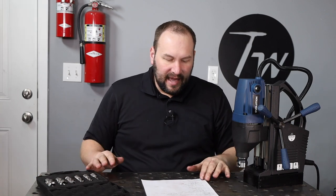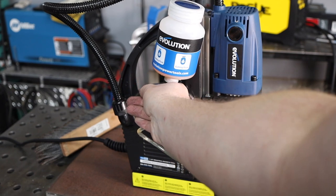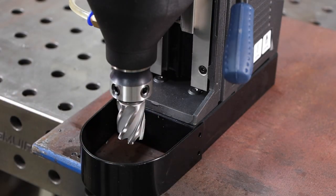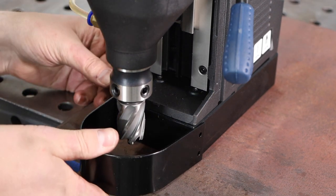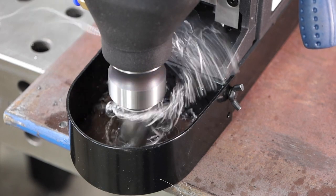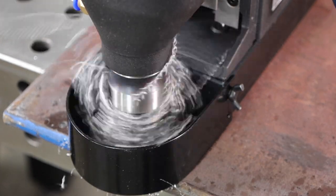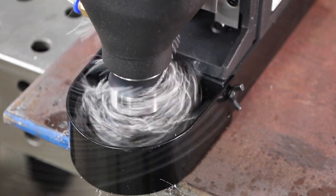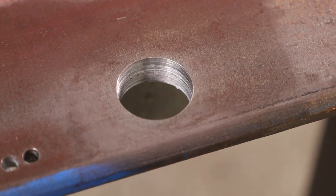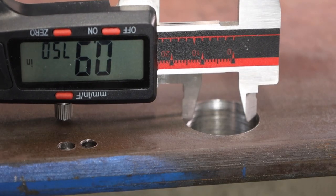So you need to have those pins in place. With the annular cutter installed, I'm also going to add some coolant to this cutting fluid tank and attach it to the drill on the side. There's a valve that'll regulate the flow so I can adjust how much fluid I'm getting. Then I'll go ahead and install the guard around the outside for protection. I'll line up my hole and drill my way through — that coolant is flowing down through the hose to keep everything lubricated and prevent overheating. I'm not having to apply a lot of force to cut through, and it's making it through pretty quickly. I'm drilling a one inch or 25 millimeter diameter hole right now. When I finished up and measured the diameter with my calipers, it came out really close to the exact size — within five thousandths of an inch on a one inch hole, which is really good.